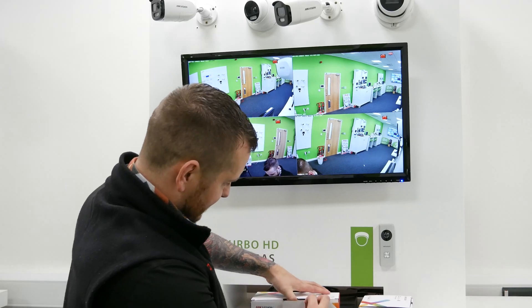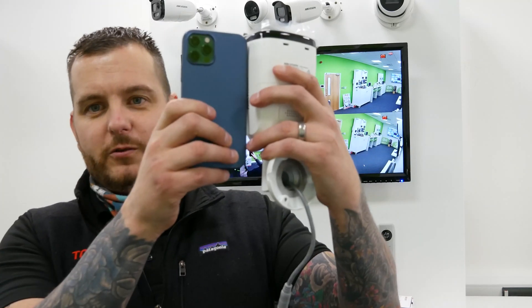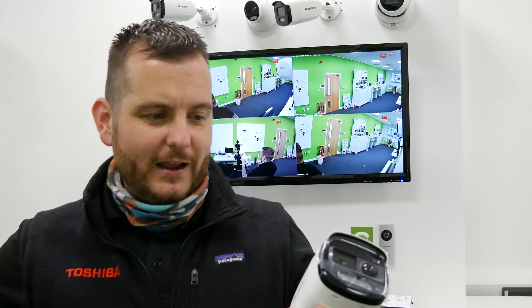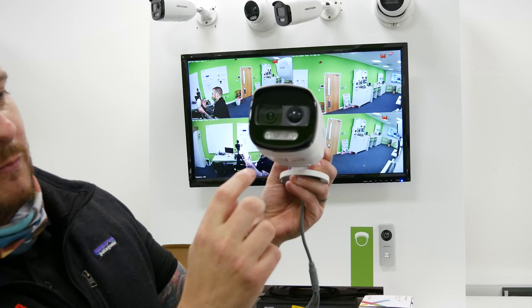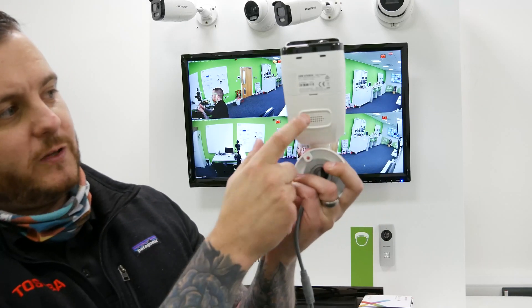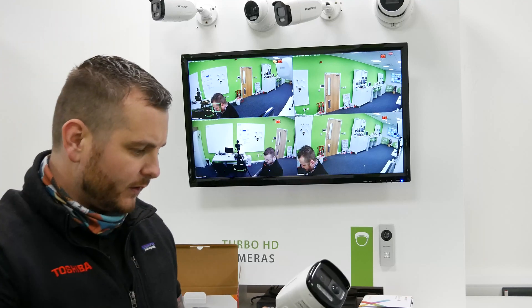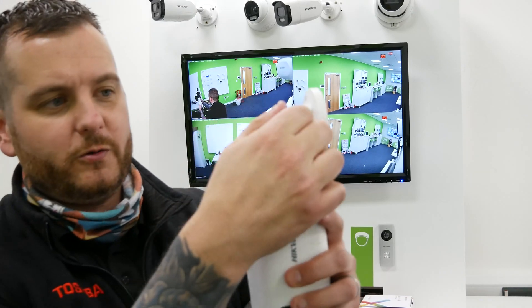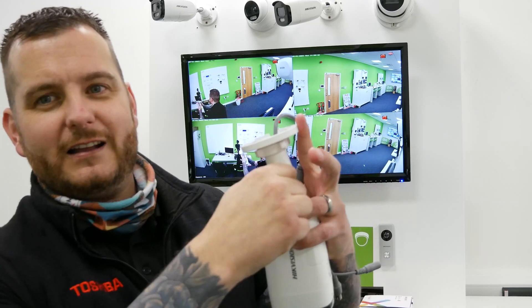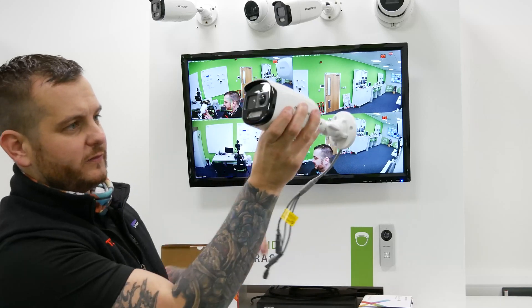If I get the bullet out first, you can see the red and blue flashing light on the box itself. Inside the box you get the mounting screws, the manual, and this small bullet camera — similar size lengthwise to an iPhone 12 Pro. Peel off that front film: you can see the PIR, the camera module, and the active deterrent module with the speaker. On the fly lead you've got the BNC connection, the 12 volt connection, and the audible out connection — so you can connect an external speaker if required. There's also an adjustable bracket with a thumb screw to lock it into the crocodile teeth, making it really hard to bend.